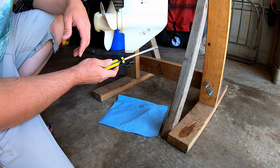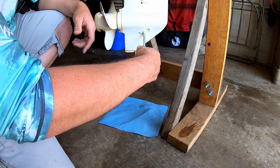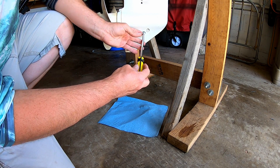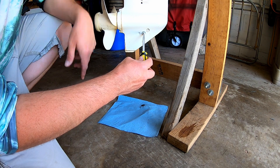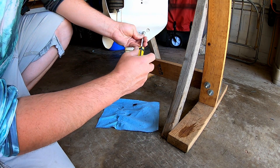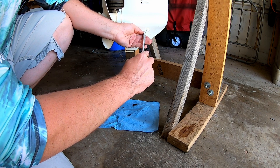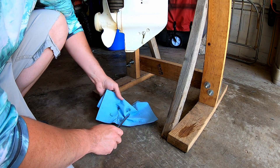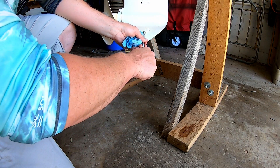The other thing we want to check is that we don't have any water infiltration to the lower unit, so I'm just going to crack this drain plug and let a little bit out to make sure we don't have any water settled on the bottom. Before we run this motor on the actual water, we're going to do a lower unit gear oil change so that we are assured we have fresh good oil in there. But that'll be good enough just to get it running — make sure we're not running any water in the lower unit. Good to go.